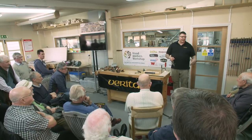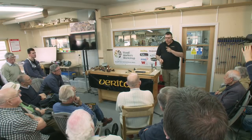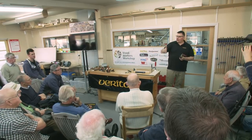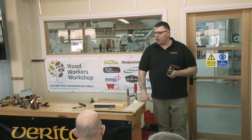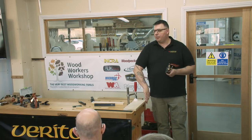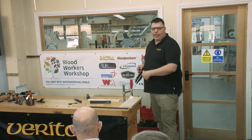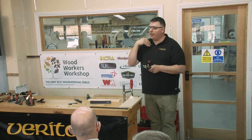So, as I was saying, the tendency is to come all the way back here and make your first pass all the way across. That would be an error, because what you're depending on is that this fence is going to travel perfectly along the side here and not wander at all, okay? Blades like to take the path of least resistance, and so if you've got a bit of wood that's a bit softer or what have you, it's going to want to follow that, and that may include coming off of the side of the board, which can be problematic. So what I always recommend to people is that you start at the front and then you come back a little bit and then back and back and back until you get a full plow. Then this will now register in that groove so that you get a straighter result, okay?